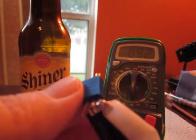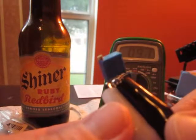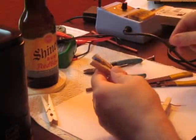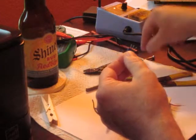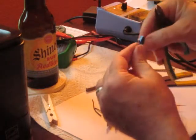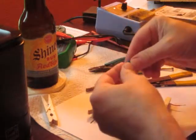So I'm going to cut the old one out and solder leads onto these. I think I'm just going to epoxy this onto the outside of the chassis so I can easily get to it, and use some heat shrink tubing on it so it's nice and safe and goes inside. That is going to be sweet. I took this little instrument and zeroed it down so that the wiper pointer — right now it's at one ohm resistance. I'm going to cut off the leg that's not by the little screw, because I just need two wires.